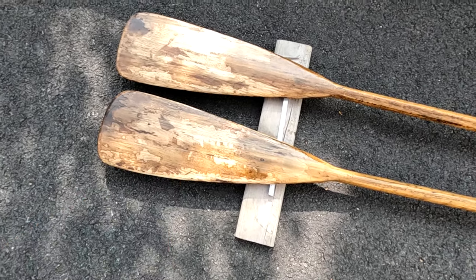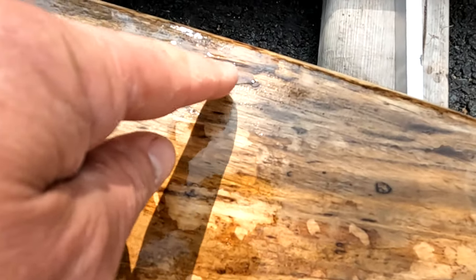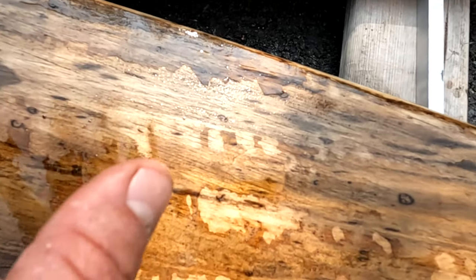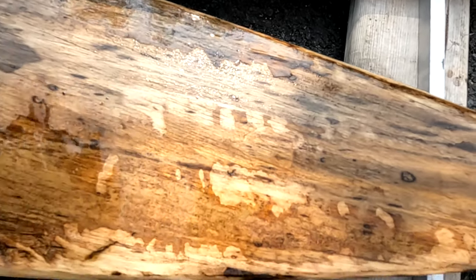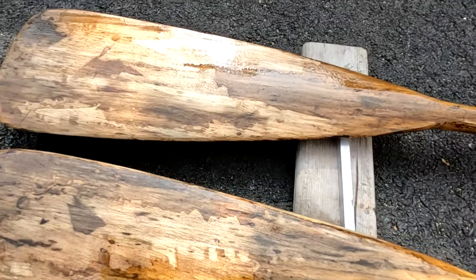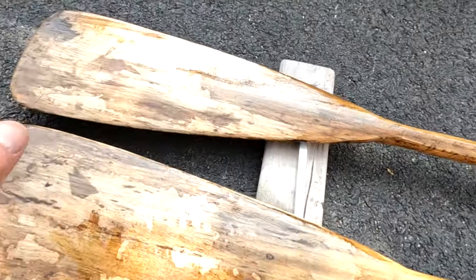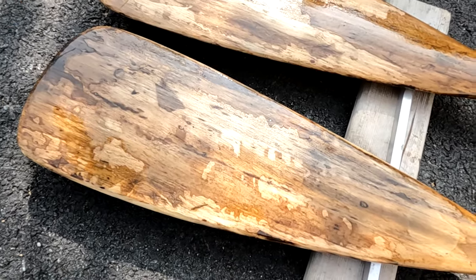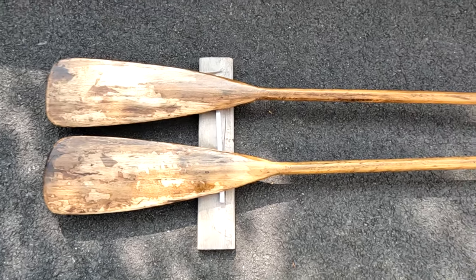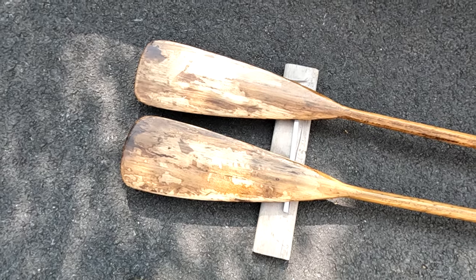Once this is good and dry, all the little edges where the leftover paint from long ago didn't scrape off will become kind of brittle from just having been painted, and I can sand it and get it a little bit smoother, right? So once this is dry, I sand it and hit it with another coat and see how it feels. It might need a third coat. At least two coats is always good. A third coat might not hurt. It depends on how much time I've got before it rains next time. But once you're at this stage, it's easy to add coats of paint. You don't have to go too crazy with it.